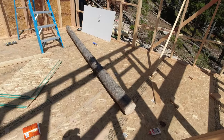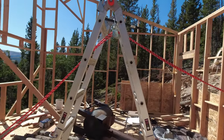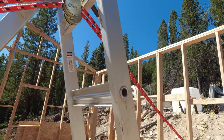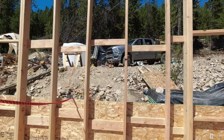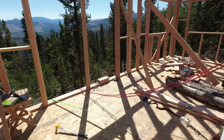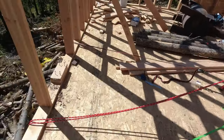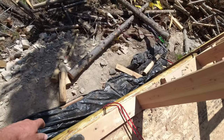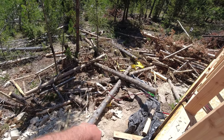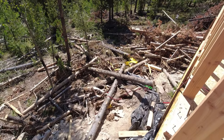Because the timbers are green and incredibly heavy, I devised this jerry-rigged crane support doohickey with some rope and the winch attached to the truck. I didn't want to put any lateral force on the foundation, so it's all downward force through the ladder, with the rope going over the edge. I need three more of these timbers and then three more for the actual beam up top.